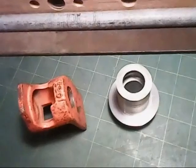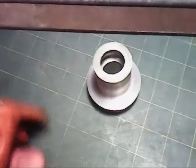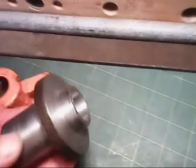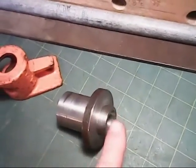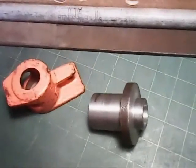Okay, the next thing to do now would be to start making the grooves in here. This big groove across here, and this slot right inside here. And the way to do that will be to put this on my indexing jig. I'll use a 5C collet and grab it here and do all the machining on the side here. That's coming up next to my mill.